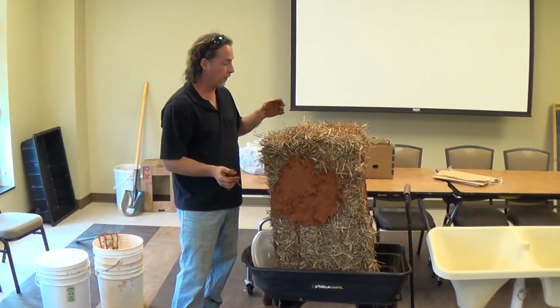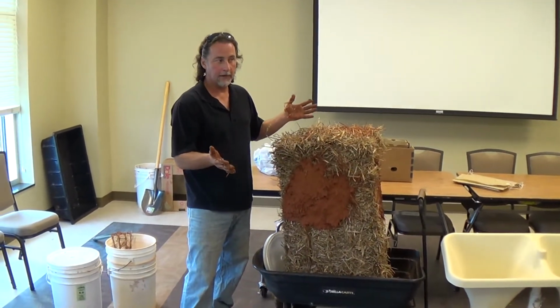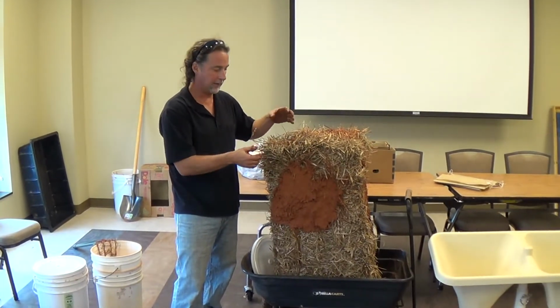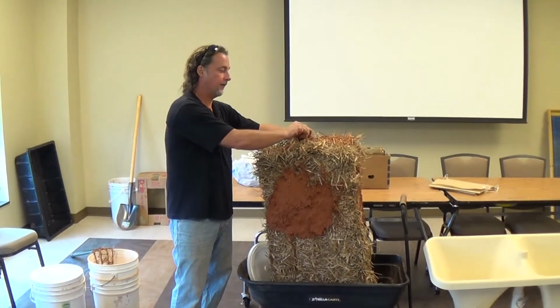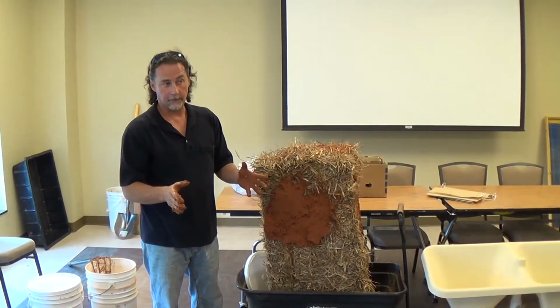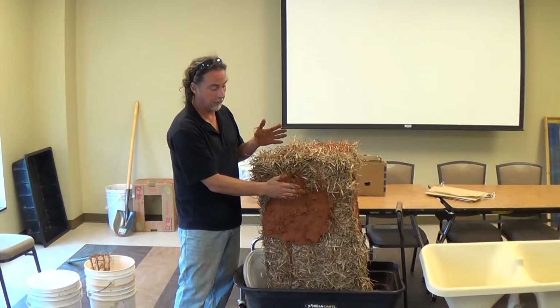And then the next coat, you take a bucket and an electric weed eater or something like that, and you take your full straw and put it in there and you just weed eat your hay a little bit to make little pieces. And this next coat, you want it to be much thicker because you want to end up with 4 inches altogether. 4 inches of this stuff altogether.